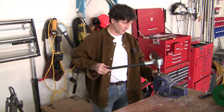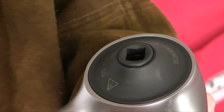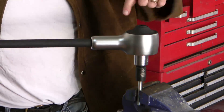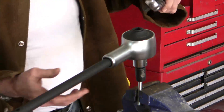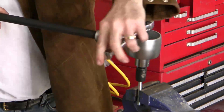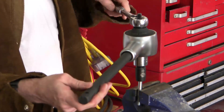Now it's not what you'd think. You'd think that you'd turn with this bar, but you don't. This is not used the way a normal wrench is used. If you turn the bar here you just get a counterclockwise spinning of the input device. What you really do is put your wrench on the female end like this and then turn your wrench this way. What's happening is the two bars are going in opposite directions — they'll go either way, on or off — and the bolt is standing still.